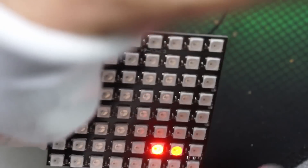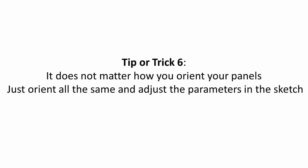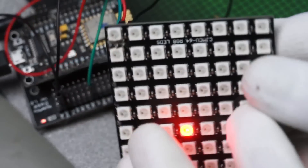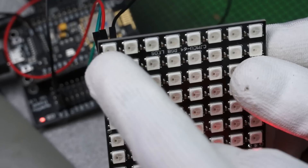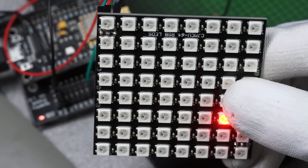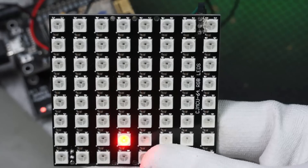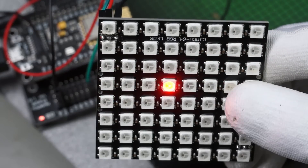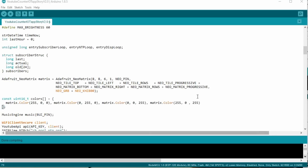The sketch confirms this. I could have mounted the matrix in any other direction, and then the first pixel position would have to be adjusted. Tip or trick six: it does not matter how you orient your panels — just orient all of them the same. Find the first pixel on the tile and adjust the parameters in the sketch accordingly. I suggest using the silkscreen on the back of the PCB for alignment; then your first pin is top-left and the connectors are also placed better. We also check how the pixels are connected on the tile — in rows or columns — and adjust the parameters accordingly.